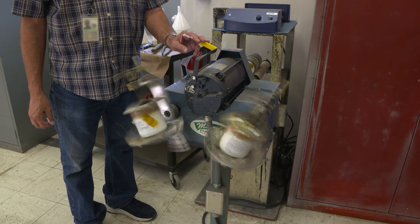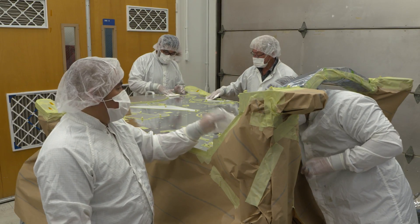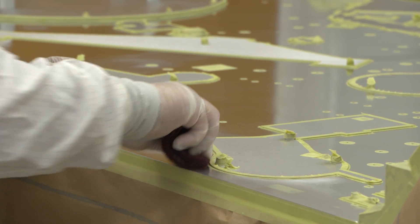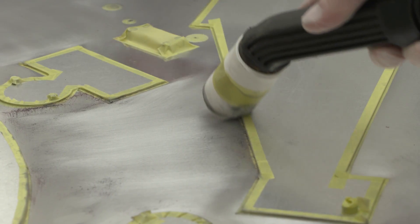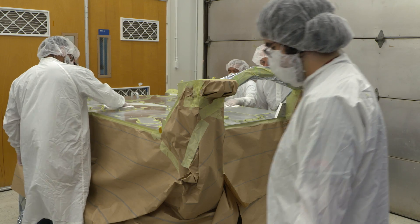For the paint to work right, it has to be just the right thickness and evenly applied. To prepare the aluminum surfaces, we have to make sure they're very clean. The shiny aluminum surface is then reduced to more of a scuffed surface that's ready to accept paint. This generates dust as well, and that all has to be cleaned and vacuumed off so that we don't have any particles that are going to get under the paint and keep it from adhering or cause it to flake off.